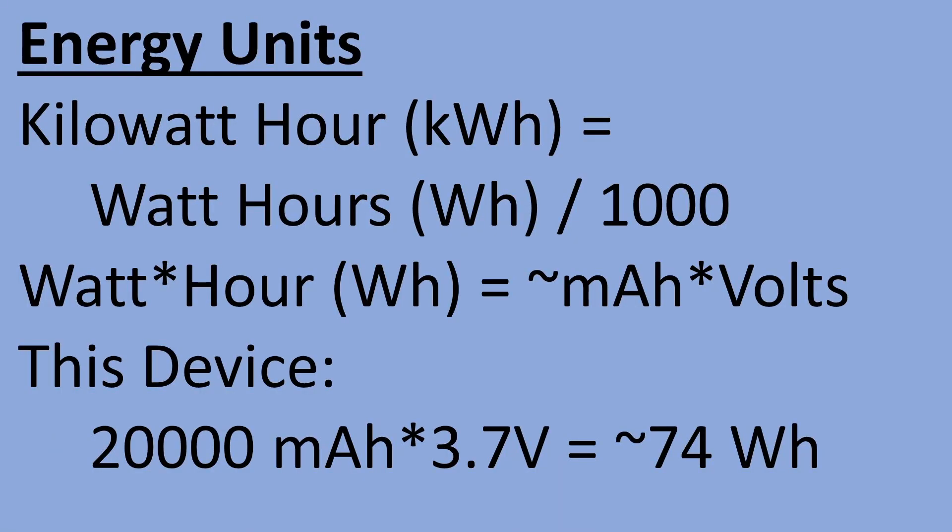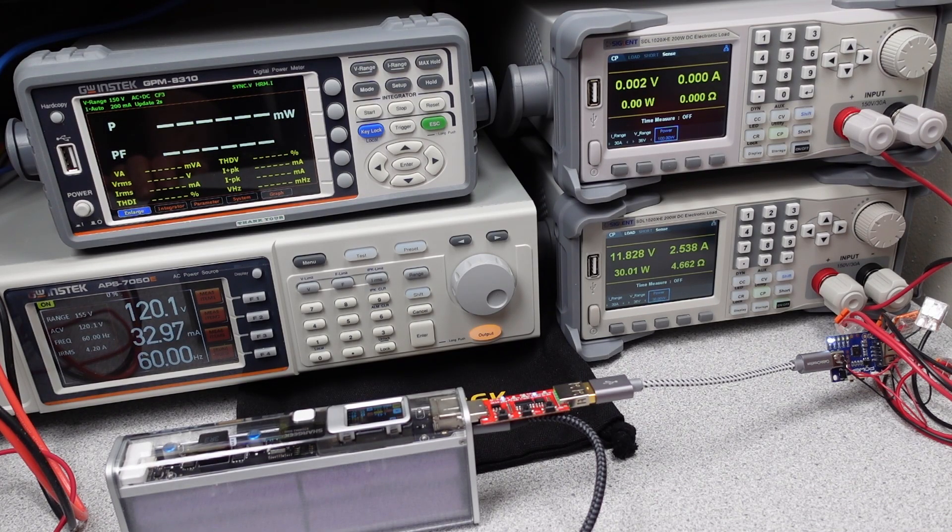Power banks do some kind of marketing nonsense when it comes to battery capacity. In this case, 20,000 mAh — which is a big number. We can see how many cells are in this thing, so we can deduce that they are each 5,000 mAh battery cells. Basically, the unit of energy we care about is watt-hours, like your electricity bill. Talking about a capacity in terms of mAh essentially only gives you a piece of the picture, and since the voltage of the battery is a variable, it tells you nothing. What we need to see is watt-hours. They do print this in tiny text on the bank, but it could be a little more clear. Knowing the usable capacity would be a big improvement, since the basic math to go from watts to usage time for any device is very easy. This is an example of providing the least information possible.